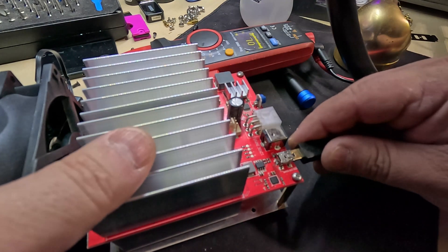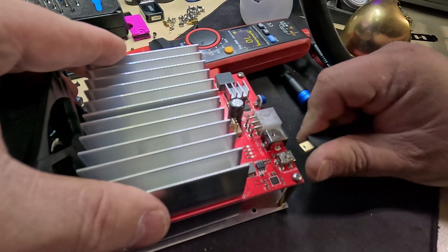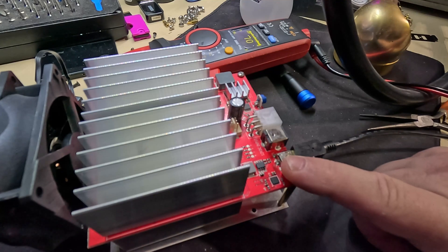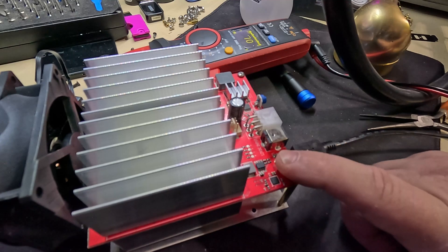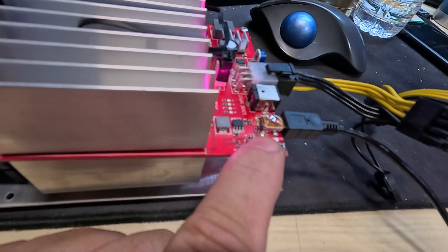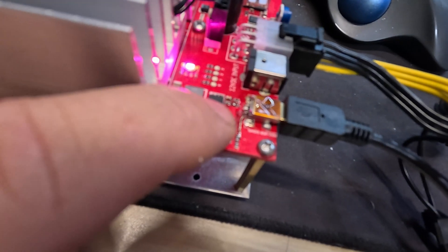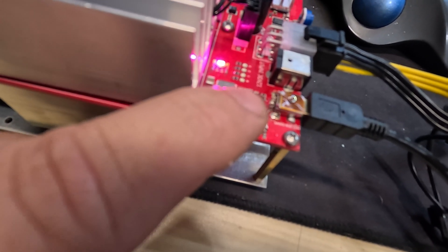Let's try the actual cord. Yep, that's good. So let me get a breakout board with a six pin just so we can power it up, and I'm going to look and see if I can see this connecting via USB. That was a pain in the butt. I had to use a new mini USB plug — thankfully I had plenty of those. I had to rerun one of the traces because one of the pads got lifted off the mini USB landing spot right there. I resoldered everything three or four times just to get it right and make sure it wouldn't short out with the casing.